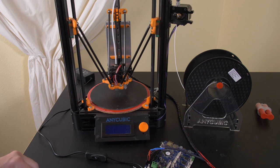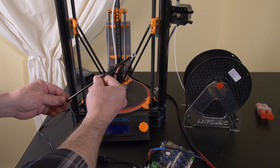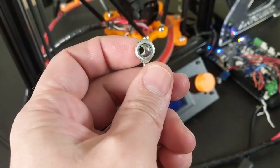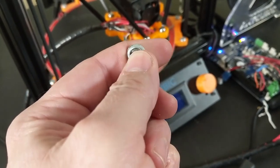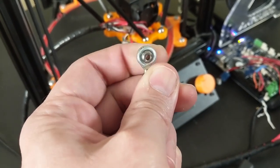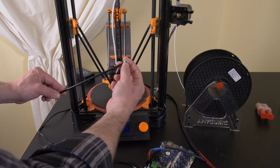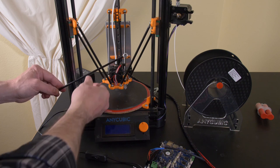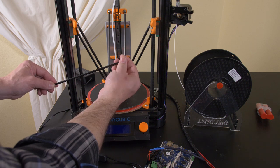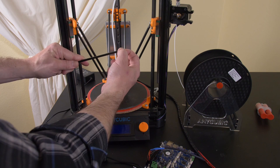The other problem that I was having in these older videos is with these original push rods. You can see these are made by having an eyelet that encompasses a ball bearing, and that ball bearing has a hole drilled in it so that you can put a bolt through it. These are made by swaging, or compressing, the rim of the eyelet to capture that ball bearing. That swaging process is probably really finicky to get right. If you over swage them, then the ball does not move, and if you under swage them, then you've got wiggle or slop or lash. And that's what's going on here.